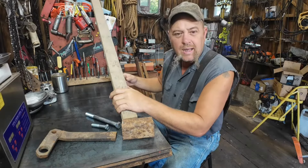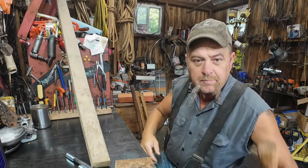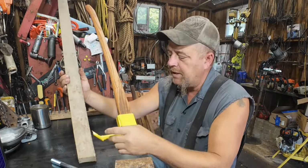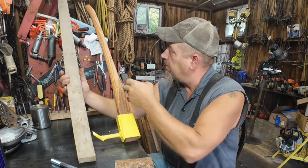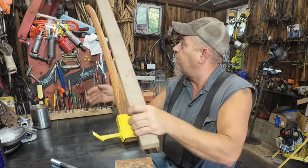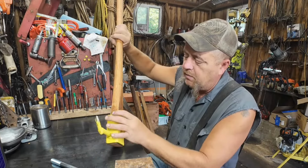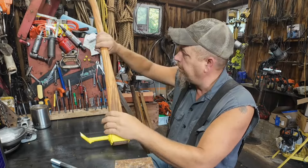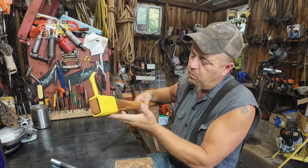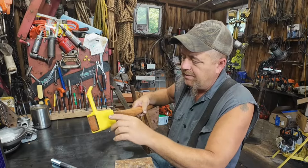Old piece of ash had drying out in the barn, and we whittled everything away on there that wasn't a handle. Let me throw a finished product up here, and we'll see what we got. Now, of course, first thing we did, we just whittled this handle out right quick with a plane and a 4.5 inch grinder on a sanding disc. We left this square down here where this head's at, and it's actually at a little bit of a taper down on one face. This side's square, that side's tapered out, and I'll show you in just a second what we did.